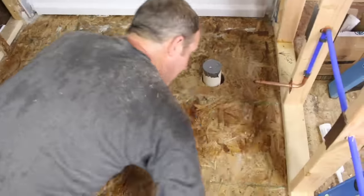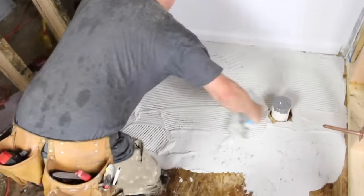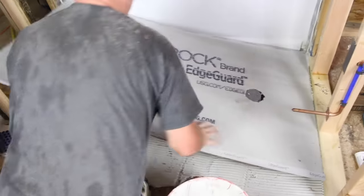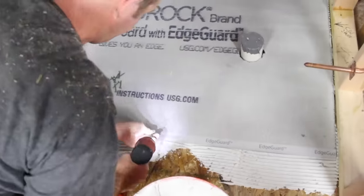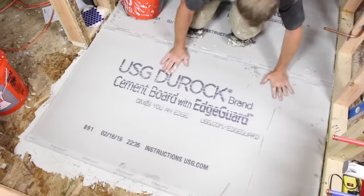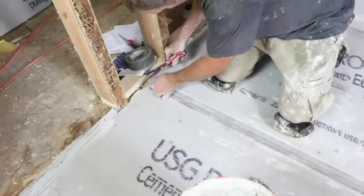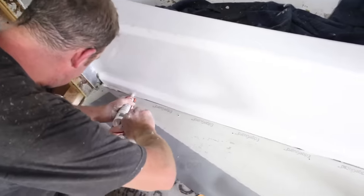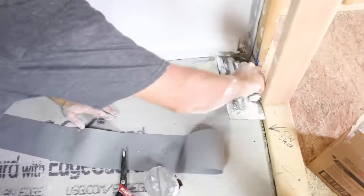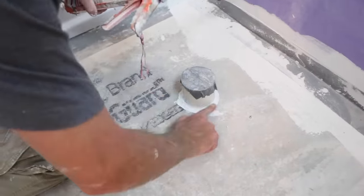This is one of the best methods for installing penny tiles. Dampen your wood subfloor, apply modified thinset using directional troweling, and add Durock or any other type of cement board to that. You need to use alkali-resistant screws for cement board, and after each subsequent board, you need to waterproof between them using alkali-resistant mesh tape and modified thinset. Just make sure it's a thin layer. Then you can add a sealant up against the tub along with a banding, and use that same sealant around your toilet flange.